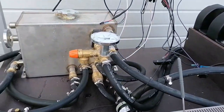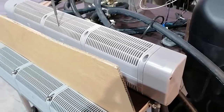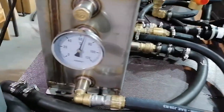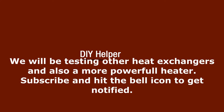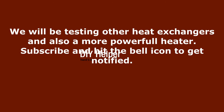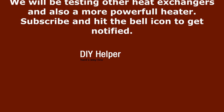So after all this testing we have our results. We can see that in normal operation this little 5kW heater should run these two heat exchangers without a problem, even in colder conditions. Also with the current setup we can supply hot water for about 15 minutes, which is sufficient for a camper. Thank you for watching this video and I hope it helps you make an informed choice for your setup in your mobile home, camper, or boat, and choose the right heater and heat exchangers so the whole system runs smoothly.